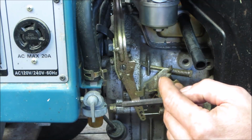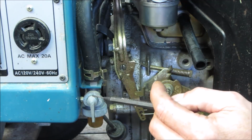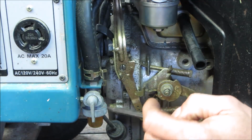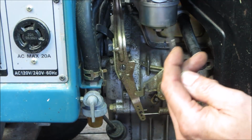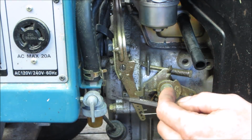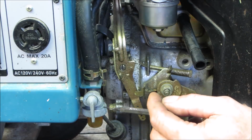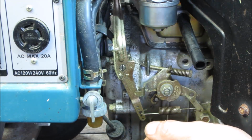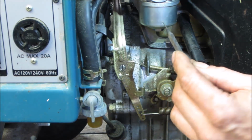And it was leaking around here, but it only leaked when the petcock was open. So I wonder if maybe the leak was here and not in the carburetor, and possibly that's what they missed the last time it was doing it, and they replaced the carburetor thinking it was the issue. Again, that's just a guess, but that is what I ran into, that the seal was not holding right here. So I don't see anything wet now.